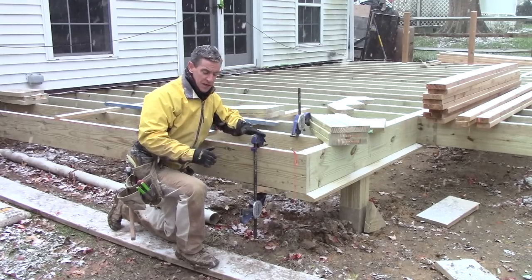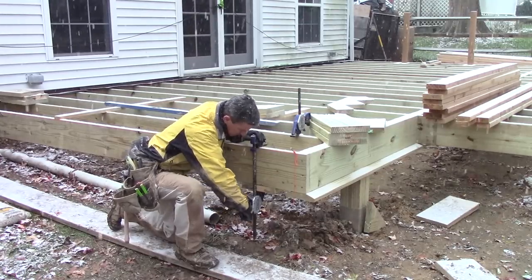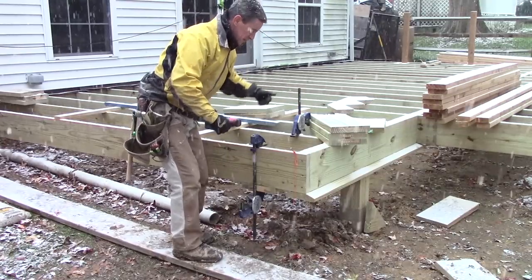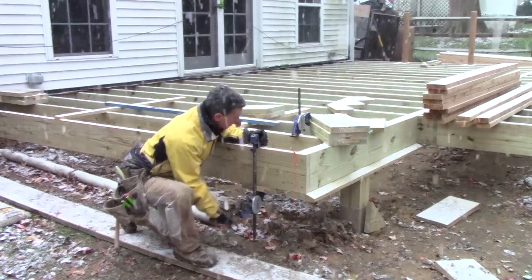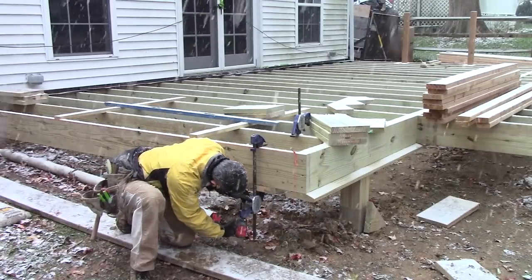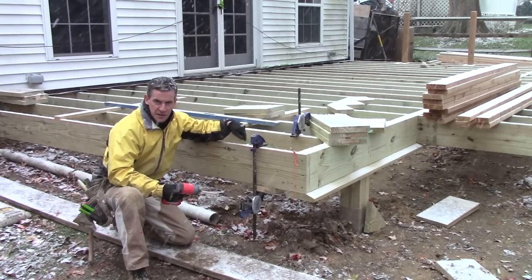Back to the how-to. I've got two clamps set up here for a 2x10 block underneath. I'm just going to squeeze this tight because I'm going to use this later. When we set the posts in our post pockets, they're going to bottom out right here. And I'm going to screw these up with some SPAX HCRX number 10 by 3 screws.